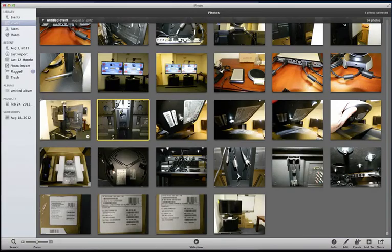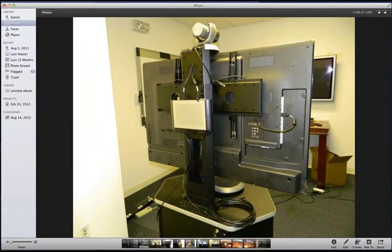If I show you here, here's a pretty good shot of how that sits there. The codec itself actually sits, sort of looks like it's upside down, in this little slot, and you'll have to work it in there carefully. The Velcro is there to make sure that it doesn't move around on you. And the reason why we've chosen to mount that on the outside of the T-bar as opposed to just leaving it on the rack inside the cart is for proper cooling.